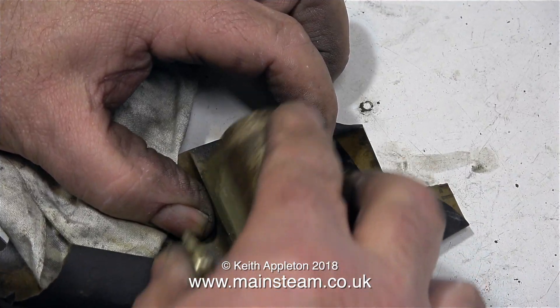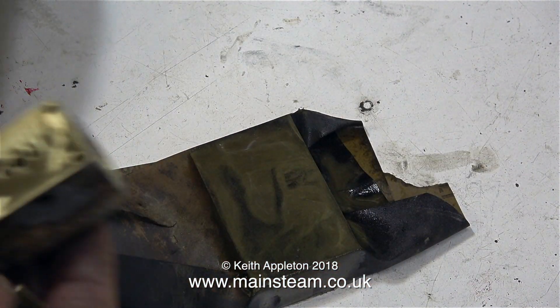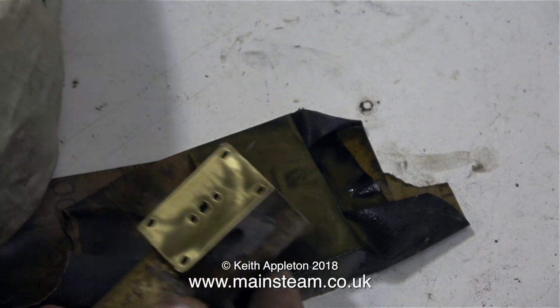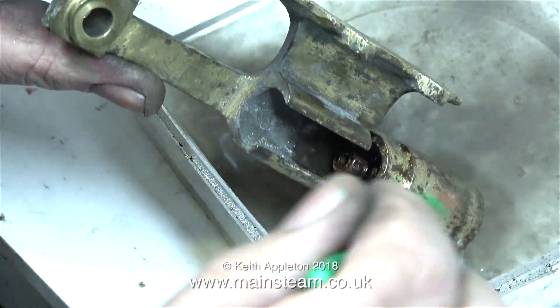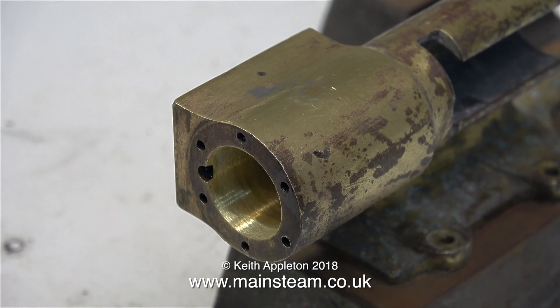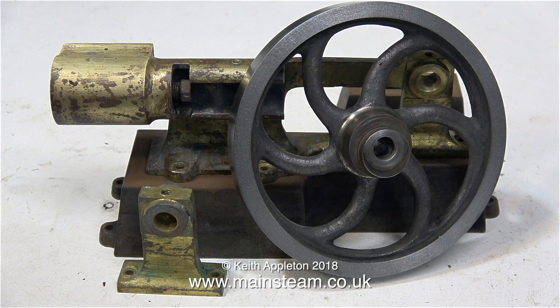The more I look at this casting, the worse it seems to be. Even on the port face, there are some marks that haven't been caused by the valve - it's just not a good casting. I assume that this engine was manufactured in Germany between the wars, so I suppose it depends how close to the end of World War One this was made, as to the quality of the metal available to make it. The main thing is though, the cylinder bore is very nice indeed, and it no longer has a totally unnecessary large hole drilled at the midway point. So in the previous episode I machined the flywheel - there's a bit more to do on that - and now the cylinder is once again a serviceable item. I just need to make a connecting rod, a piston rod, and a piston, as well as a crosshead and a cylinder cover. But that's it for now, thanks for watching, and I hope you found it useful.